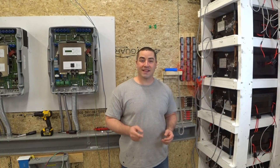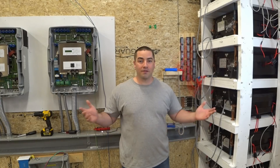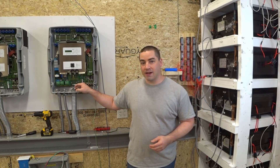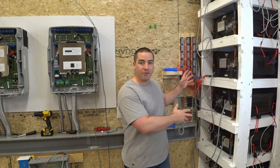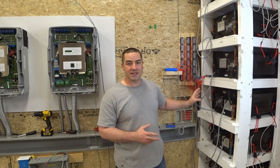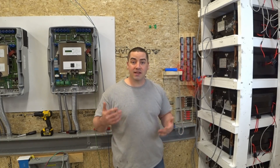I set this camera angle up really wide to give you the broad view of everything that's going on. Over here I had to replace these plastic bushings with some metal ones that allow for grounding. On this side I still have a mess of wires and I need to clean these things up. I've got to do something with the bus bars, add some shunts and circuit breakers.